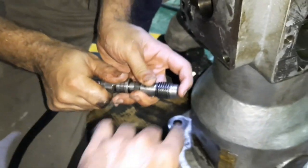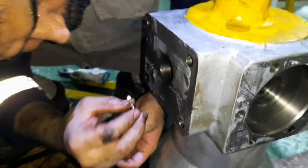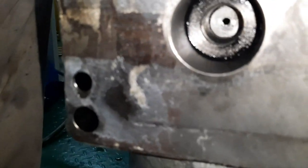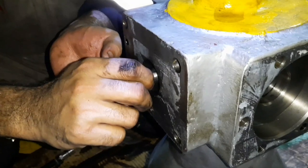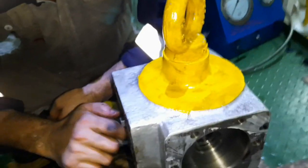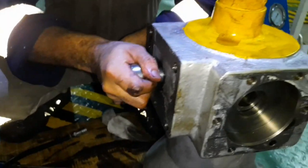This is the orifice plug with a small bore on its sealing face. The blocked hole prevents the sealing oil dose from reaching the exhaust valve spindle. Clear the hole of sludge deposits and make sure the air passes through the hole. Fix the disc before putting back the orifice plug. Once the orifice plug hole is clear, the sealing oil flow is restored back.